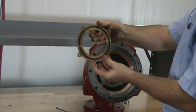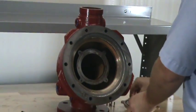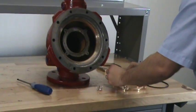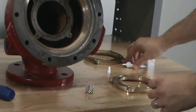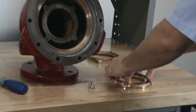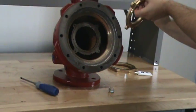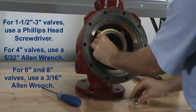As you will notice, the o-ring is installed into the groove of the seat. To install the new seat, you need to apply the lubricant to the groove of the seat. Once the lubricant is applied, you can install the o-ring into the groove. With the o-ring now installed, you can install the new seat by lining up the holes and installing the new screws.